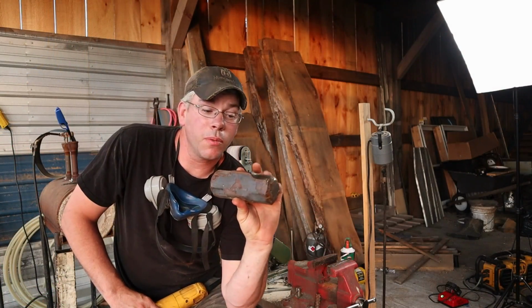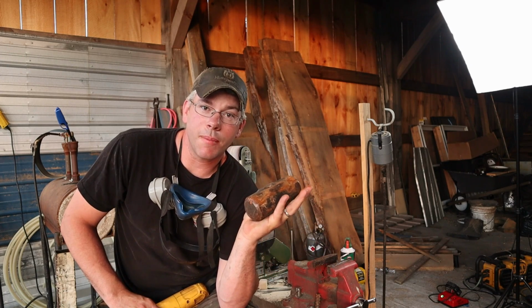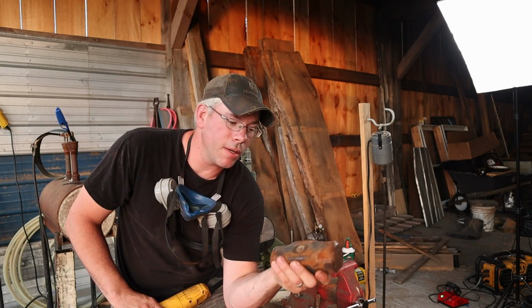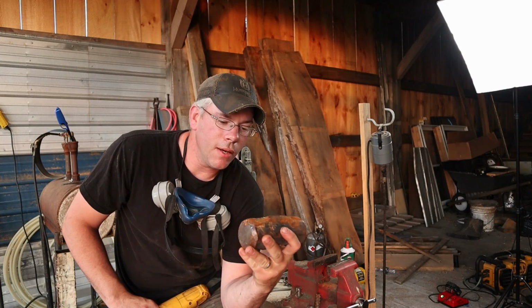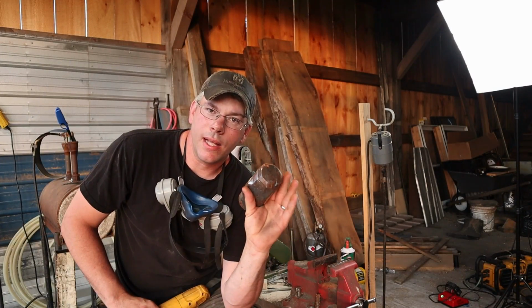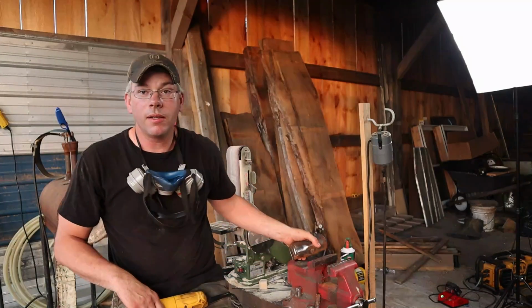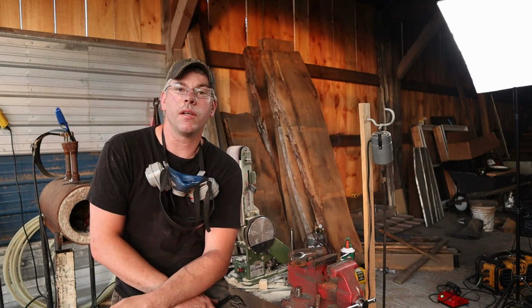So you guys wondering what we're doing with this thing yet? This is an 8-pound sledgehammer head. This is a cheap hardware store sledgehammer I picked up a long time ago. The handle broke off of it, and as I'm learning the blacksmithing, I'm finding that it's a real good time moving metal, especially the 5/8 inch thick 1080 steel we're using.